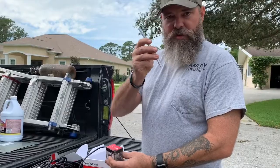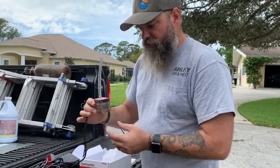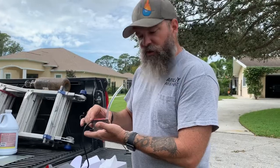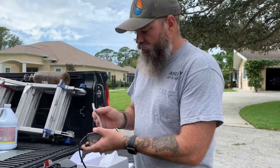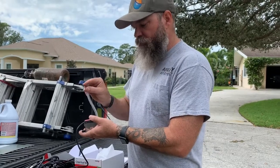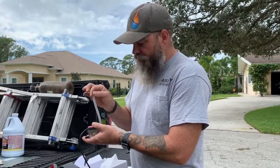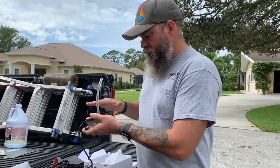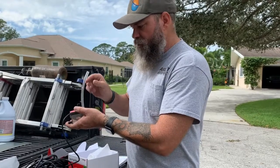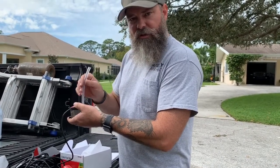The last thing you need to know is this little breather tube goes right here on top. The reason for this tube is that the reservoir sits on the bottom section of the air handler at the very lowest point. This tube needs to be installed to run up inside the unit so that this point is higher than the drain pan — because if the drain pan overflows, it's just going to drain out the top and go all over the wall. You have to have this on there so it goes higher than the drain pan, because the lowest point is going to drain out. So you have to put this breather tube on and it runs behind the air handler just higher than the drain pan.